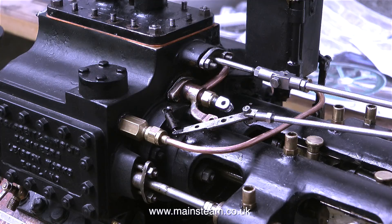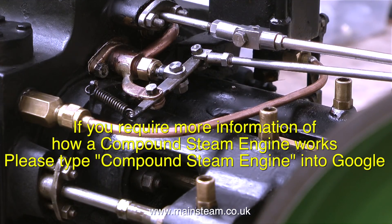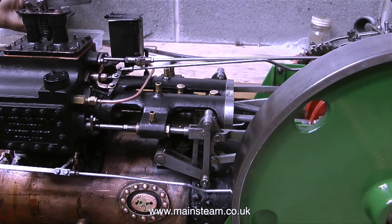When you open this valve, just by pushing it, it admits steam from the boiler directly to the low-pressure cylinder's steam chest, thus eliminating the compound running, and this makes the engine start whether it wants to or not.